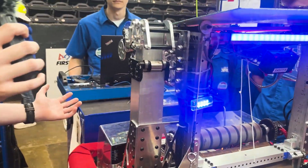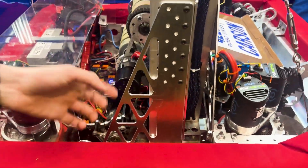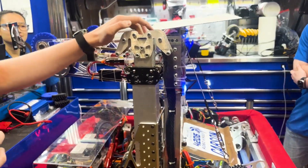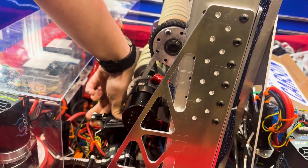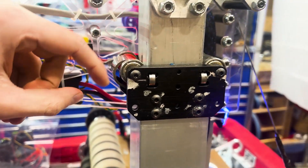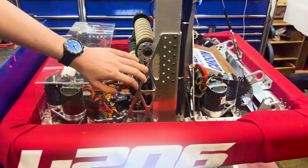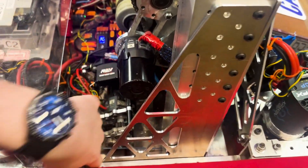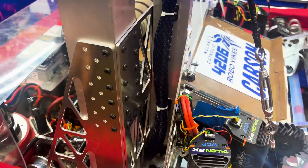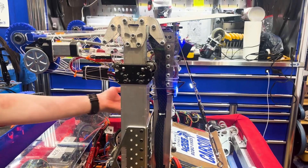Our next two systems are the climber and our pseudo elevator mechanism. For the climber, we have a gearbox down here that takes a rope into our climber. It has a knot at the top that hooks into a bolt — when you release the pawl, it feeds up slowly, powered by springs hooked into the inner bar by bolts. A gusset plate holds that all stable, and it hooks down to our chassis and into a second gusset plate that supports the climber and the elevator mechanism, which we use to lift the shooter so we can access the electrical underneath.